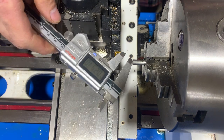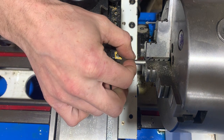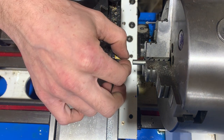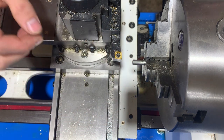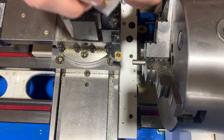Okay, I've got a 1/4-inch piece of stainless chucked up in my three jaw chuck. I need to basically make this end here thinner. Good thing I've got it in a lathe, it's very good at doing that. I'm shooting for 68 thou diameter here, a length of, what are my numbers, 230. So that'll be the piece that goes through, I'll show you on the large one.